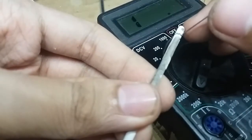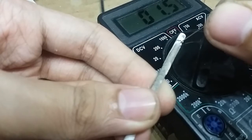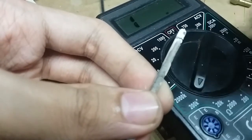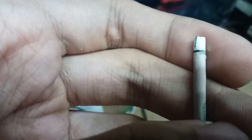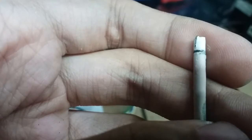When we check its resistance, the nichrome wire is still intact up to a point — we can see that it breaks at the topmost part. The actual fault is right there: it's burnt. That is why it failed.